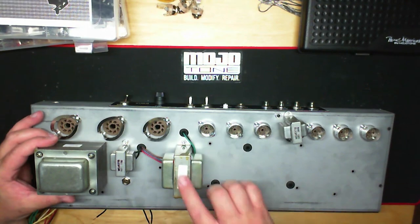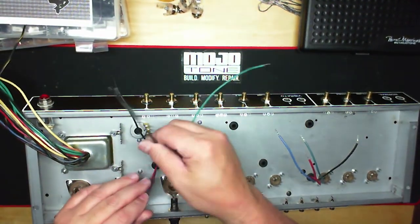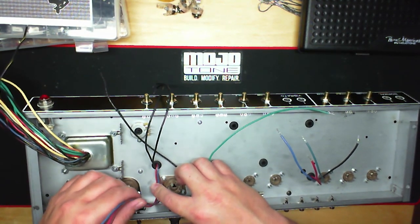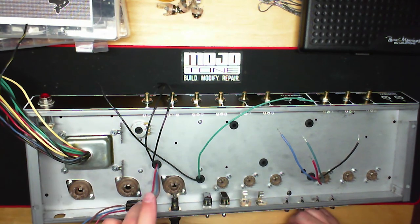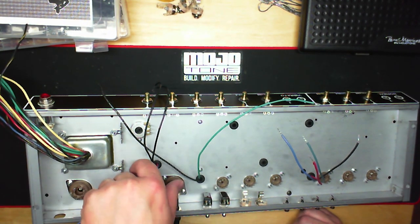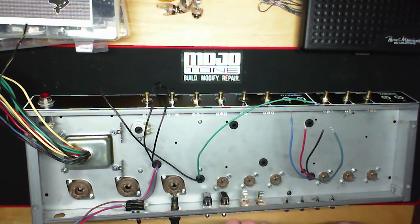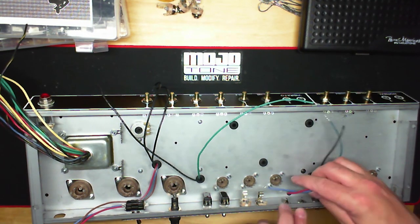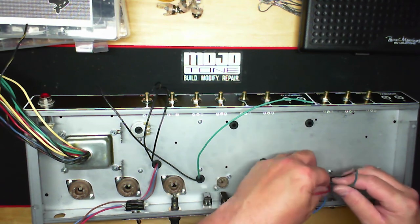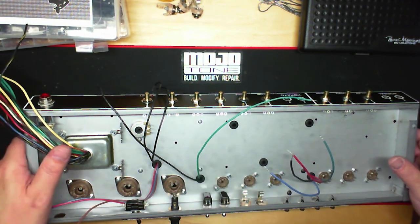Now, when I flip this back over, I'm talking about the output transformer. If you notice the primaries, where they're going to go is to the plates and the B plus of the actual amp itself. So it was very efficient in the way they did this. They minimized transformer lead length to the actual tube sockets themselves with everything across the amp. Of course, the reverb driver's right here. The jacks for that, you'll have the two primaries on the tubes, one towards the power supply for this, and then you have your secondaries, which go to a ground.